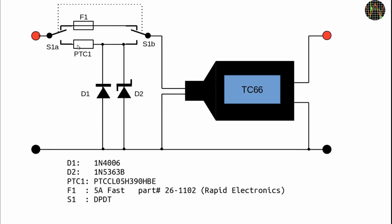Thankfully, we only need one circuit to protect both inputs because as far as the voltage measurements are concerned, the right terminal is directly connected to the left. The 15 milliohm resistor between them is like a piece of wire. That circuit still won't do any good during current, power or resistance measurements, but at least it won't cost you a fuse trying.